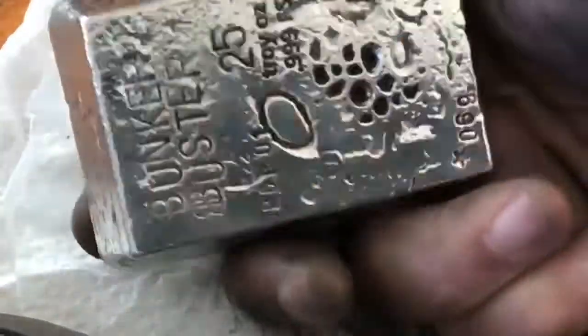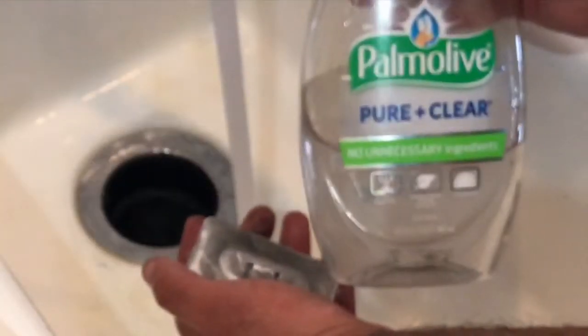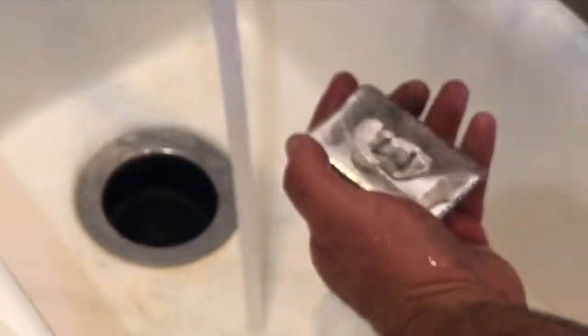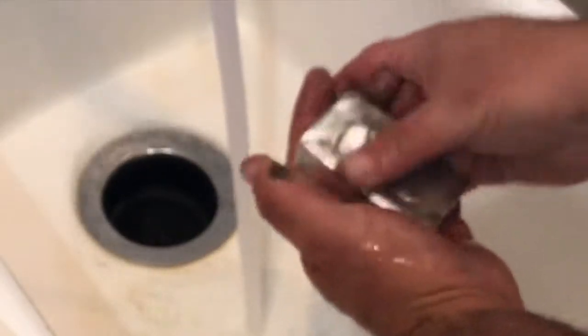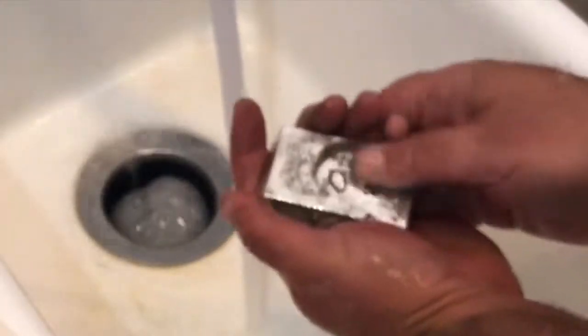After a couple rounds of dealing with details, I follow up with a nice extensive hand polish. It allows the depth of finish that I was mentioning. So now it's time to wash off the extra Flitz polish. That whole process of polishing with the Dremel probably took about an hour. And now I spend some time just getting all the little bits out before I finish off with another maybe 100 hours of tumbling on this piece.